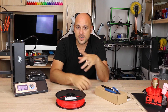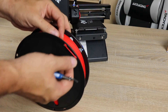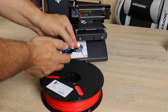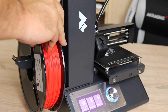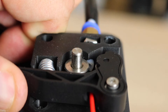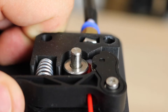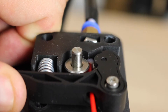So we're going to go to the printer and see this first layer. We're going to grab our roll of PLA, take the end out of the spool, and as mentioned before, cut it at a 45-degree angle. We're then going to place the spool on the spool holder, grab the end of the filament, press on the extruder lever, and insert it into the PTFE tube, pushing all the way in until the filament stops going in.